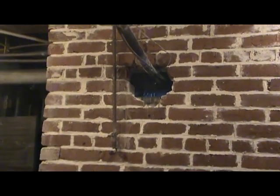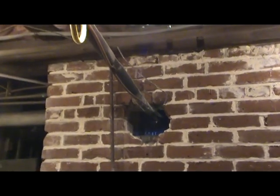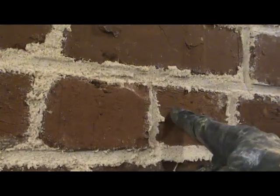All right, I just completed installing about 20 pounds dry mix of mortar, and that did about half the job. So I am mixing up one other batch to finish off this side of the wall. What you get is you try to strike the joint, filling up the joint fully and then kind of striking it flush with the brick. The bricks aren't all that flush — there are lots of bricks that stick out — so you do what you can and get a kind of flush joint. The idea there is to get the maximum amount of mortar in the joint, and that's the maximum amount of holding power you'll have.